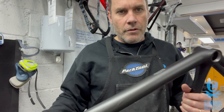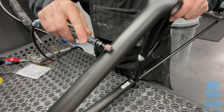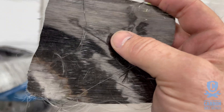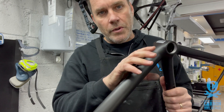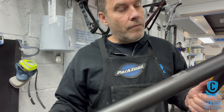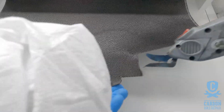One of the interesting points to note about super light frames like this - at around 570 grams - is that they use a very high compression mold to make this frame. Less carbon, less resin, and what resin they do have in the mold is squeezed out probably more than any other. The process is a little bit different to your standard frame in order to get this incredibly light result.